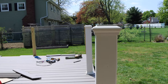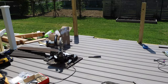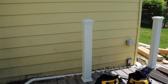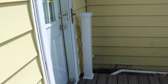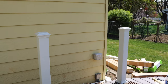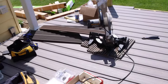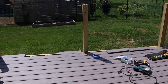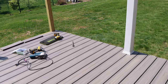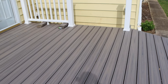We'll get to that step a little later on. Because the 4x4s are a little bit crooked, we're going to get our railings up first before we silicone those covers and put them on permanently. For the 4x4 against the house, we cut that one before we installed it because we would not be able to turn the circular saw around to cut it on the other side — we could cut it with a reciprocating saw but I elected to cut it short beforehand. Next we're going to go around and continue with the rest of the railings — cut them to size and slide our sleeve and post cover on.